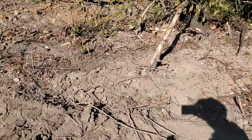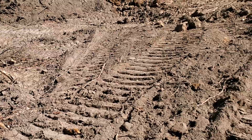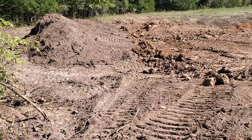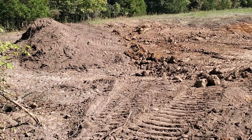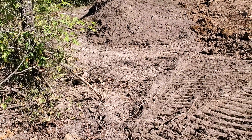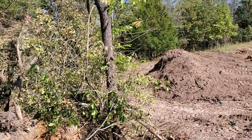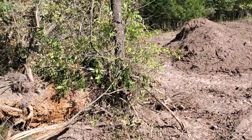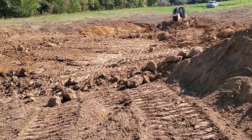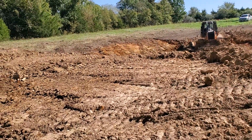The pipe's going to come out here; he's going to have all this covered up and push this area off right behind the dam. The pad for the stock tank is actually back here behind the dam — about a 20 by 20 pad. The pipe comes through the dam and feeds over to our tire tank. There's a wild cherry tree we're going to take out to give us a nice square area for the tire tank. This will be no pump, no pressure tank — just good old gravity flow water coming right through that dam.